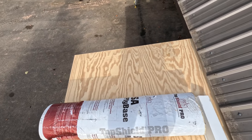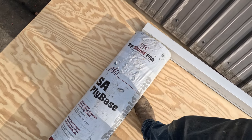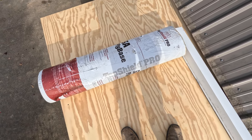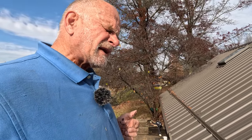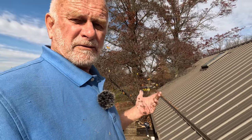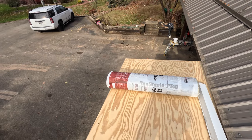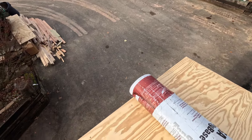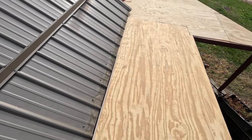There are two ways you can go about this. You can install a base ply sheet — this one is from a different company because Liberty and Home Depot don't carry the base, which is essential if you want to do a good job. You can also install the cap sheet directly on the plywood and it will work. With a base sheet it's going to be about $2.50 a square foot instead of $1.50. I use a base sheet at least on the perimeter.